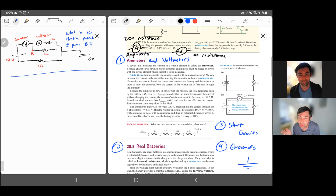In reality, the voltmeter has some finite resistance, and the ammeter has some small but maybe not negligible resistance. But in the ideal case, when we see these in the circuit diagram, whether the resistance is zero or infinite matters for how they'll affect the circuit.